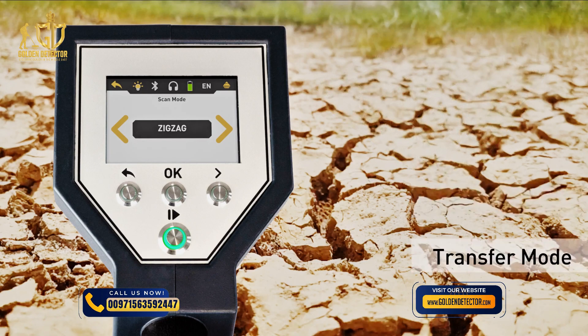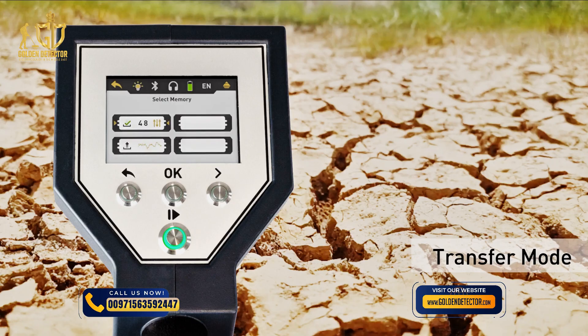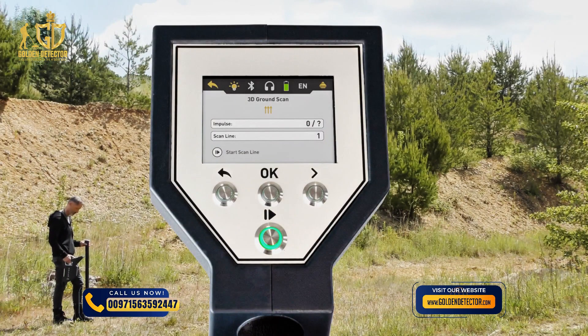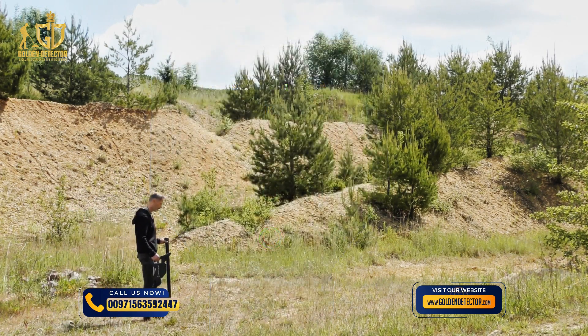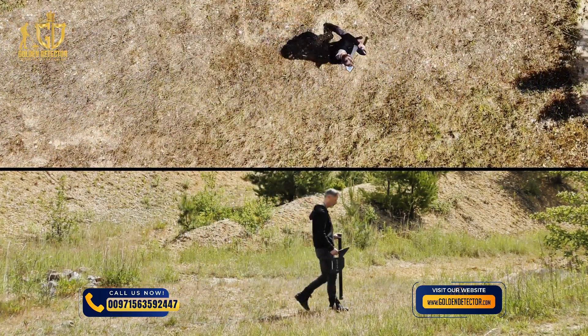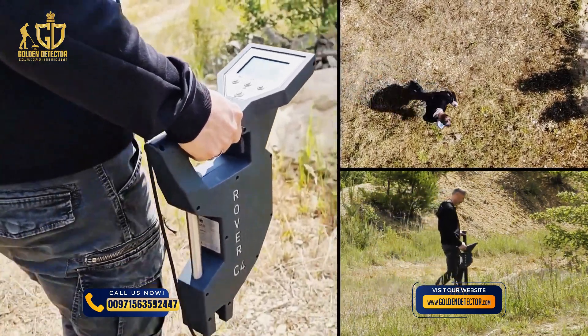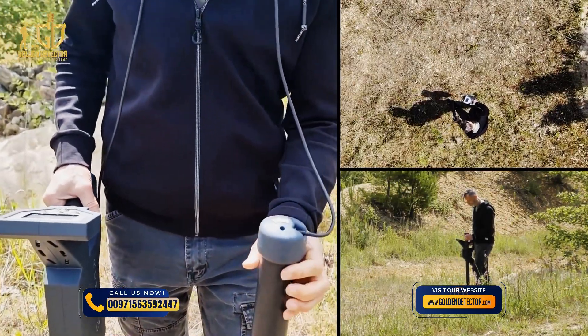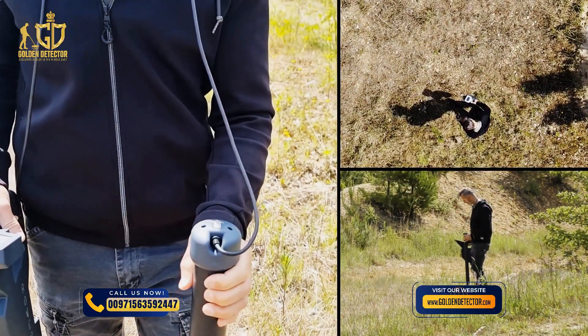Finally, define the type of data transfer. Choose memory and select a slot to store the measured data in the internal memory of the Rover C4. After selecting the four parameters, go to the starting point of your first scan line and press Start as soon as you start walking. Scan the first line to its end and press the Start/Stop button to set the field length and number of impulses. Remain at the end of the line, turn 180 degrees around your own axis, and rotate the probe so that the arrow is pointing in the same direction as in the first line.